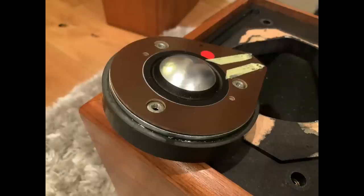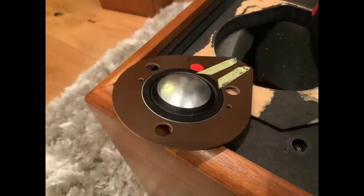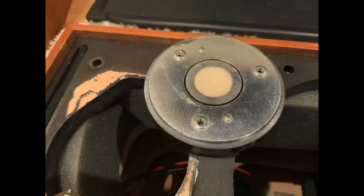Let's start with the tweeter itself. It's a one and a quarter inch aluminium dome tweeter produced using laser interferometry — essentially two lasers creating an interference pattern to very precisely predict the radiation pattern of the tweeter. The voice coil was wound directly onto the dome to increase mechanical integrity, and it has a very substantial neodymium magnet structure. Celestion claimed this tweeter had pistonic motion — working perfectly as a piston without wobbling — way above 20 kilohertz.